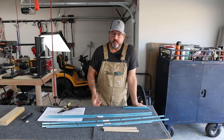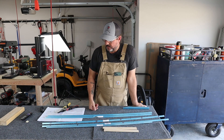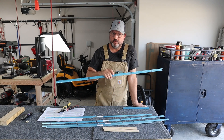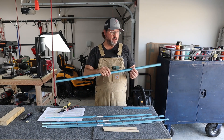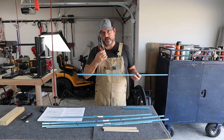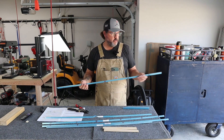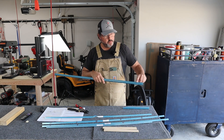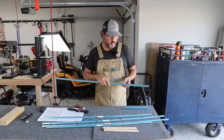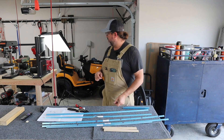The elevators will be the last piece of the empennage section that I haven't touched yet. The construction of the empennage is very similar to the rudder — it has stiffeners that all need to be separated into individual parts and then trimmed down. I separate them with aviation tin snips, and for the last batch I did the long flange trims with tin snips and then cleaned them up on the scotch brite wheel, which worked really well.